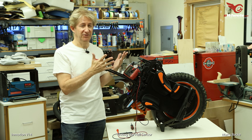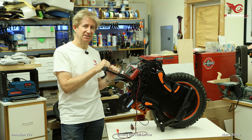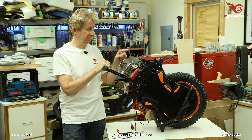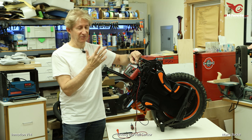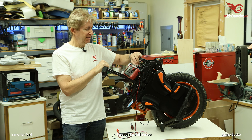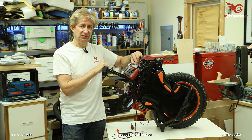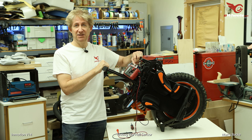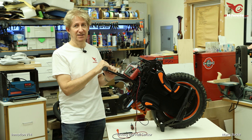It didn't literally burn up, but it's dead now. In this video, they've asked me to measure the impedance of the hall sensor cable — the hall sensor itself. If there's minimal impedance in this test, that will mean the hall sensors are functioning. If there's essentially infinite impedance, that's going to be a problem.